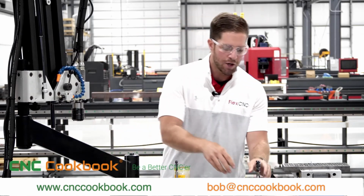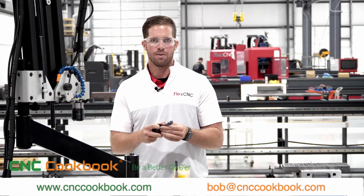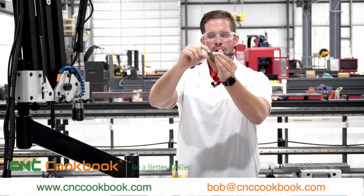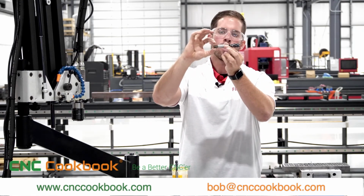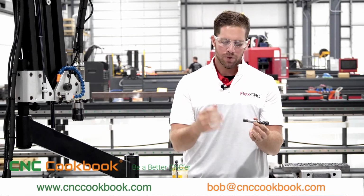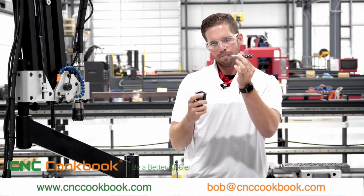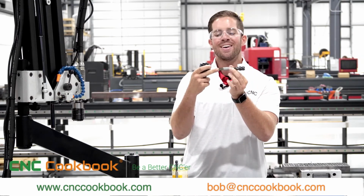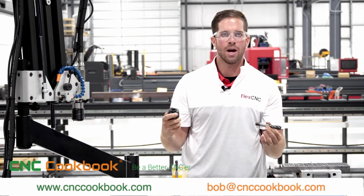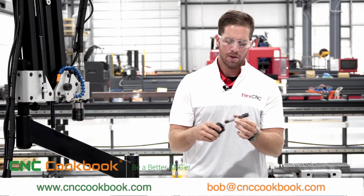But yeah, to answer your question, form taps, well, you're not going to use an NPT tap in a blind hole, obviously. But at the end of the day, what it comes down to is the square end shank of the tap and then the round shank. So as long as we know the square end shank and the round shank of the tap, we'll go ahead and kit it up into the tap holder. Typically throughout the market, tap square end shanks and round shanks are typically plus minus a couple thou, and then from there we'll help you determine how much torque you need to turn that roll forming tap. I hope that answered your question.